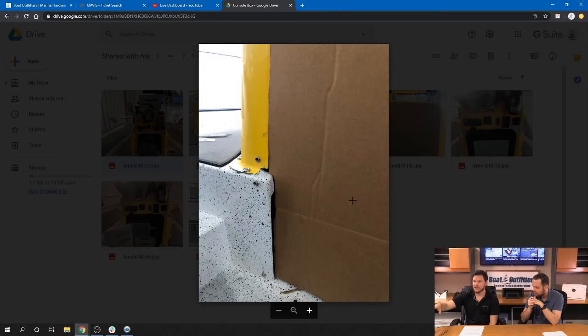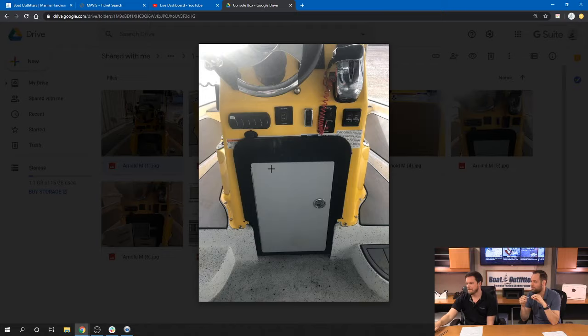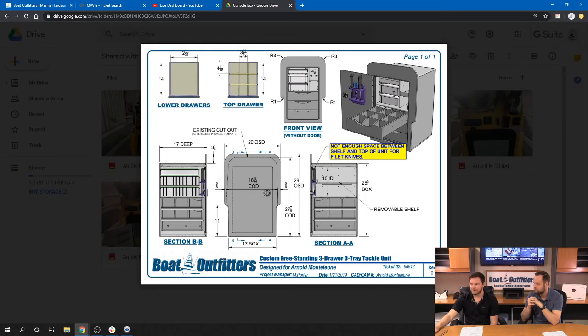What he did is he templated out this opening and incorporated these notches so that we knew where we would extend the frame so it would close out around the fiberglass. He actually sent us this piece. And this was the finished product once it was installed. Looking at the drawing, we knew we wanted some Plano trays and had some leftover space in depth where we were able to put some catch-alls for gloves, wiring, or anything. We made removable dividers in the top two drawers because he has a lot of small terminal tackle. We used half-inch drawer bottoms so one drawer could be used for lead weights — you won't have that sagging issue.